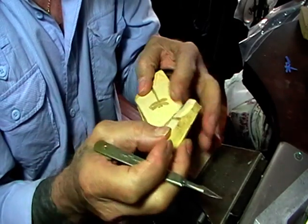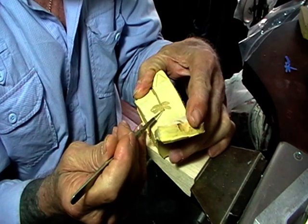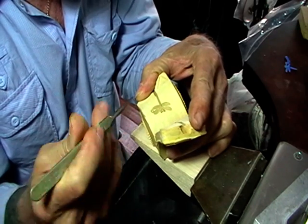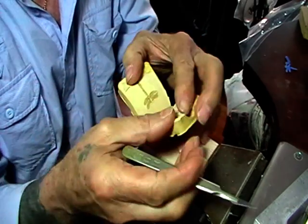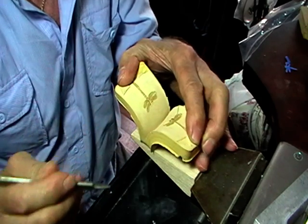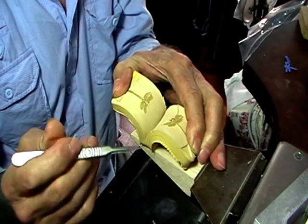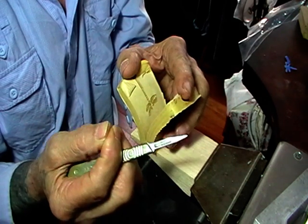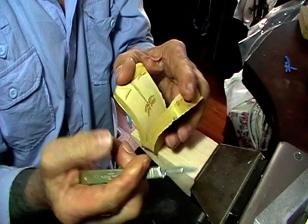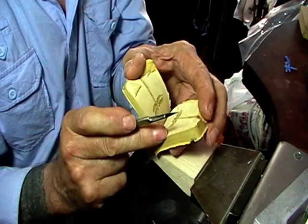One other thing — what you'll need to do is take your scalpel and put little lines going from here right to the outside of the mold, on both sides. Put talc in those cuts — spread it, put talc in the cut, and let it go back together. If you don't put talc in there, the rubber is so self-healing that it'll just close up. If you put talc in there, when you squirt the wax in, the air will be able to exit and the mold will fill completely.